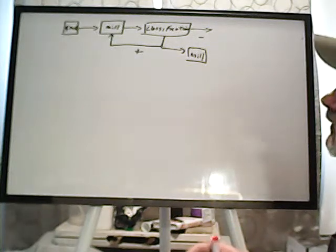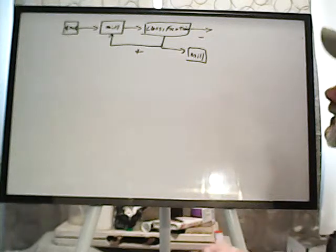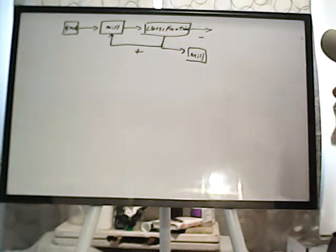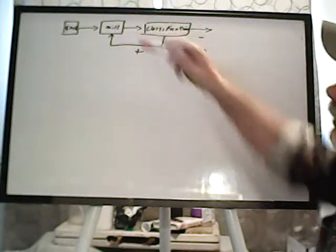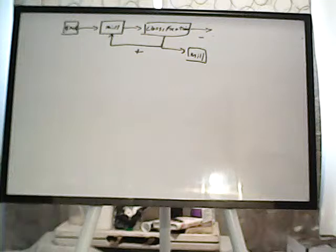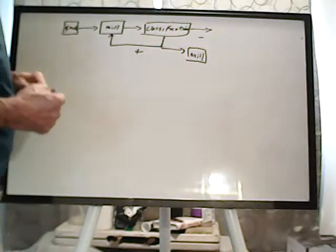Then it's a matter of the feed rate, force feeding it to the point that you are getting the size classification that you want. Right. And it may eliminate elevators or augers or something bringing material all back around to the main mill. You can set up a tumbling mill to be self-classified. Right. Yeah, absolutely. And most of the big mines will have it that way. Exactly. It'll have an output screen and stuff. Yeah, but some of them do feed it back to the main.